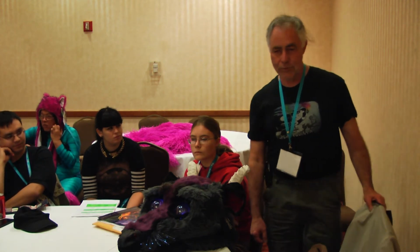So you buy an 18 volt one, you gotta get 18 volt servos. You get a 6 volt one, and the 5 volt servos that are the cheapest on the store shelves are over voltage by 1 volt. They can stand that, not too bad, as long as you don't overload them too much. You can buy 7.5 volt servos, they're a little more expensive, and they work with the 7 volt polymer batteries. But then the computer only takes 5 volts or 3 volts. Oh, rats! Now you gotta reduce the voltage.